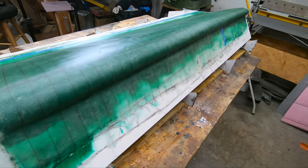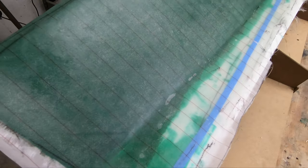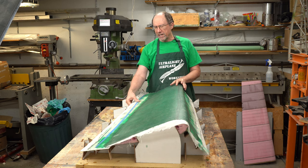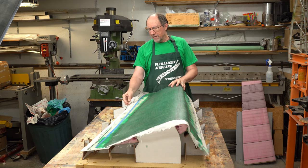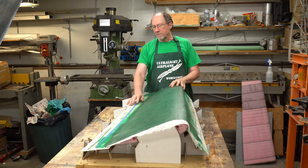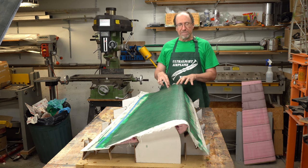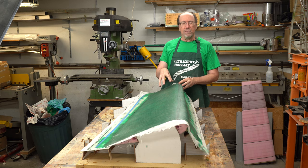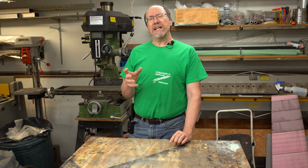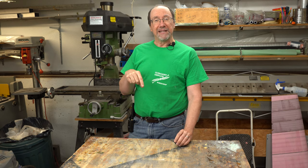Here's a little tour of what the mold looks like now with the chopped mat layer down first, the four 320 gram per square meter fiberglass layers, and the peel ply on top. I'm fairly certain the flanges of my mold will release from the white plastic flange material underneath. One problem is that the very edge of the white flange material doesn't have mold release — epoxy ran over that edge — but that should be fairly easy to break loose. I don't care if the plug extensions get damaged; I really care about being able to retrieve the mold. My first cut of this video was 50 minutes long — too long — so I'm cutting it into two parts. Part three ends here and part four will pick up right where this left off.